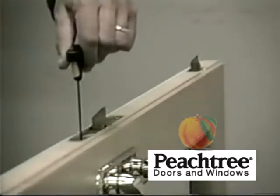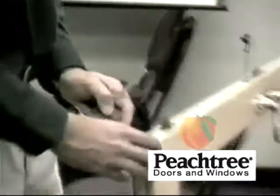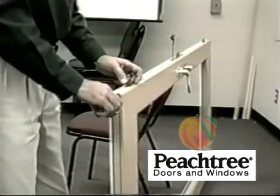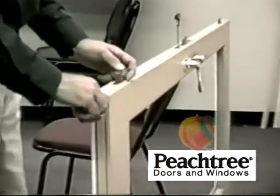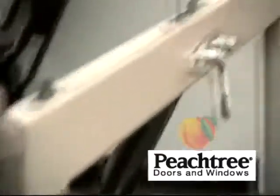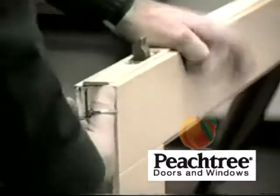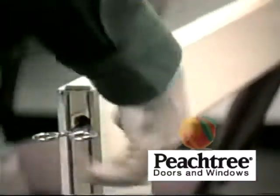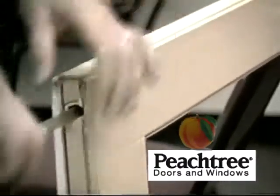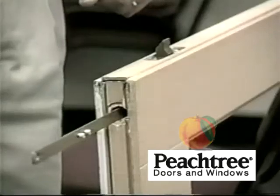Okay, so I've turned this loose 2 turns, and now I can go in. This is the bottom of the door. The sweep has been removed. I can go in about 2 to 3 inches and find the drive bar. Okay? I'm pulling the drive bar. I'm going to have to loosen this a little bit more. Here we go. It's a feisty one. Yes, it was.